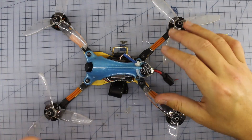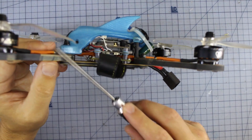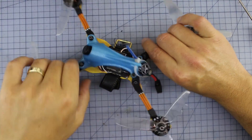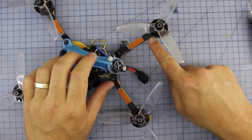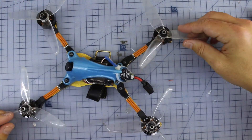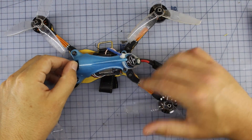Here it is on the bench. It's a five-inch racer designed to be taken to the track and ripped around. First things first — look at this carbon. I'll put a picture on screen. I've tested it on the multimeter; it is conductive, it says it's carbon on the site, but in all my years I've never seen carbon with that kind of patterning. It has a little bit of flex. There's a little printed board here instead of wires going directly to the ESCs — I'm not the biggest fan of that. The motors are 2207s, 2650 kV.